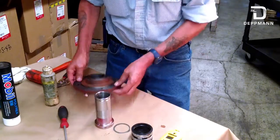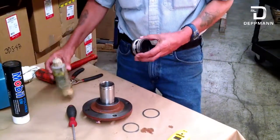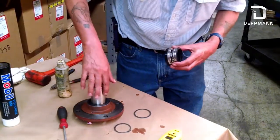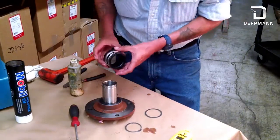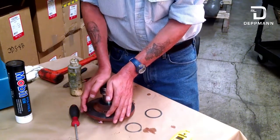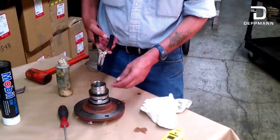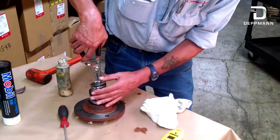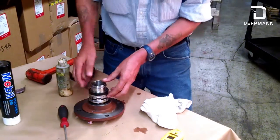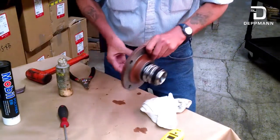After you have that piece in and your shaft clean, go ahead and put that back over the top of your shaft. Take your seal out of the box. Again, put some lubricant on that rubber — put it around there. Sometimes put a little bit, just not a lot, around the shaft. Then slide these two together. Make sure you put it on the right way — let your seal face go onto there and don't put it on backwards. Now let the seal down the sleeve. Put your e-clip back on; there's a little groove it sits into. Put that back in. You can pull the seal back up where it rides back up on there, because when this slides in and you lock this on the shaft, that gives you the right tension for your seal.